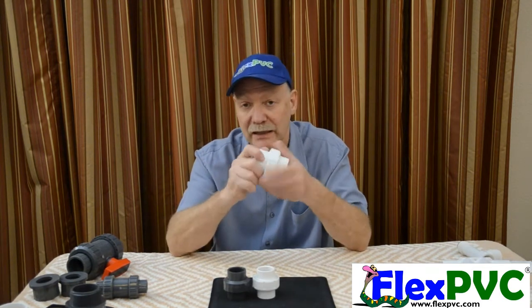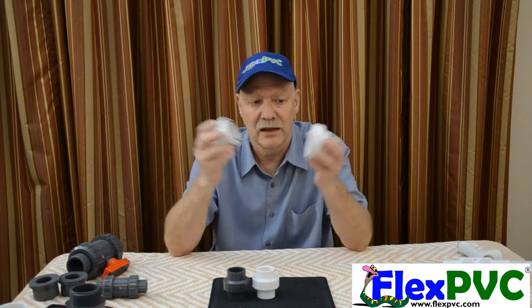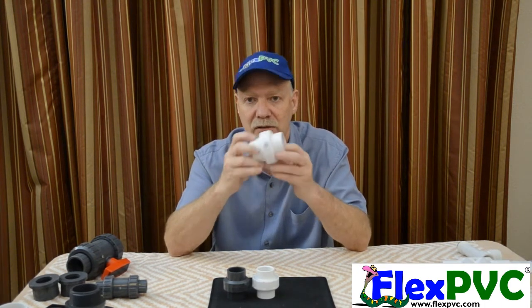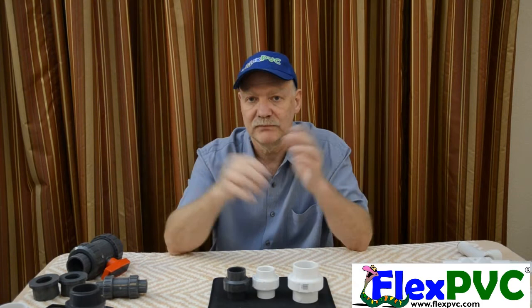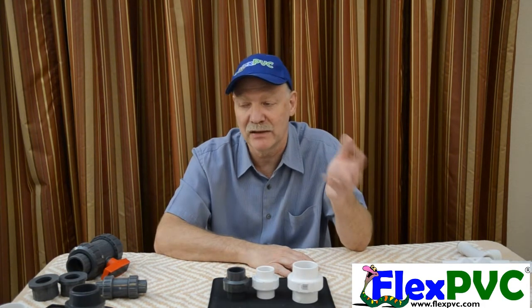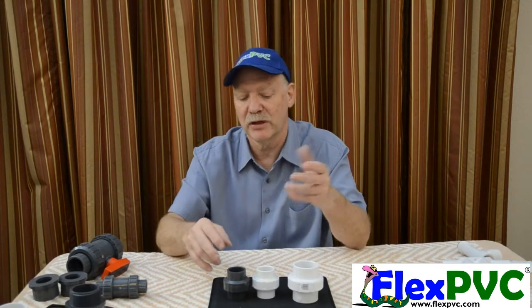Get to liking unions — you will really like them. They come in all different sizes, all different flavors. I'll make a whole other video on pump unions as well because those are separate. Learn to use unions; they're cheap and it's easy to take stuff apart and replace. I don't plumb anything without unions — everything I do has unions so I can take stuff apart. For example, if you've got a pump that's gone bad, a filter that's gone bad, or a leak somewhere, it's super easy to take a union apart, especially if you buy all the same kind.